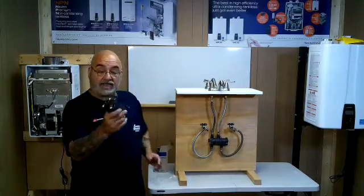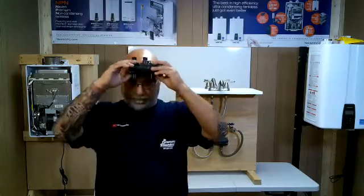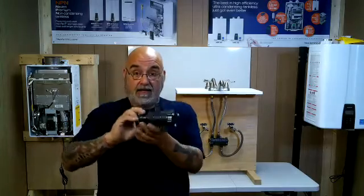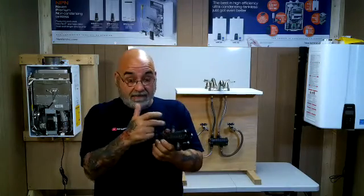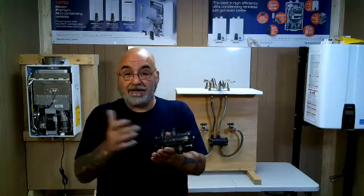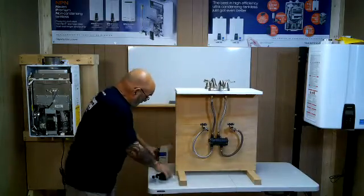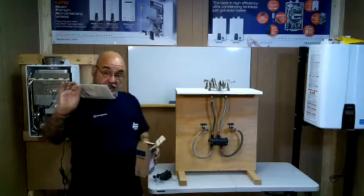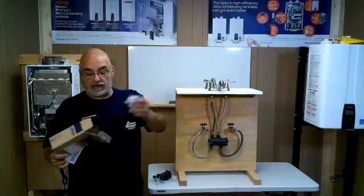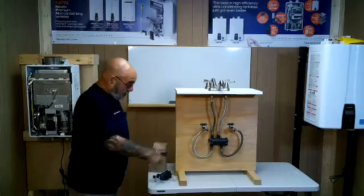So you're going to get that Navi Circ, which, again, I'm the wall, I'm the back of the cabinet. Boom, this is me. That's the way it's got to face. Okay? Just read the little words on the actual IPS fittings. So you're going to get this in a bag, you're going to get a complete instruction sheet, and you're going to get screws and mollies, but most of the time through 1/4 inch back of a cabinet, you're going to be able to put this in.